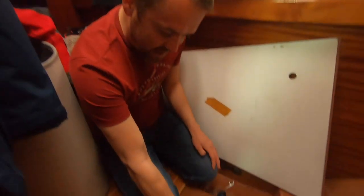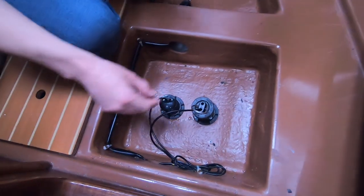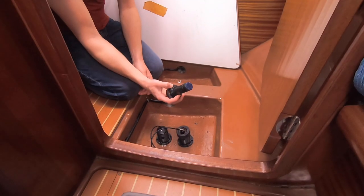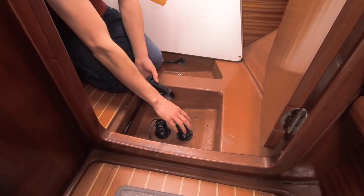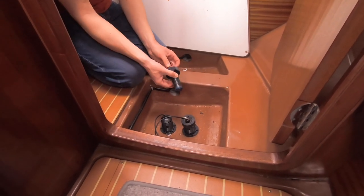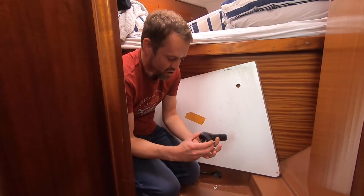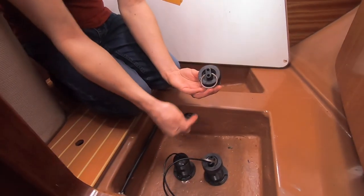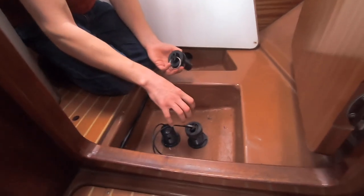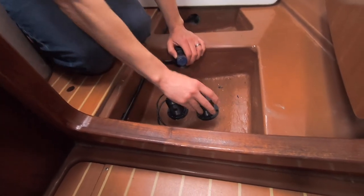One of the things we're going to look at today is our paddle wheel for our log. It's always a bit of a nerve-wracking moment. I've got the bung ready — I've got to take this out and obviously some water's going to gush in. It's always a bit of a nervous time. I've only done it a couple of times before, so I'm a little bit nervous myself. I'm going to make sure this is the right way — it's got an arrow on it, so that has to go in that way. I'll undo that one, shove that in, and that'll stop the water coming in, then we can tighten it down.